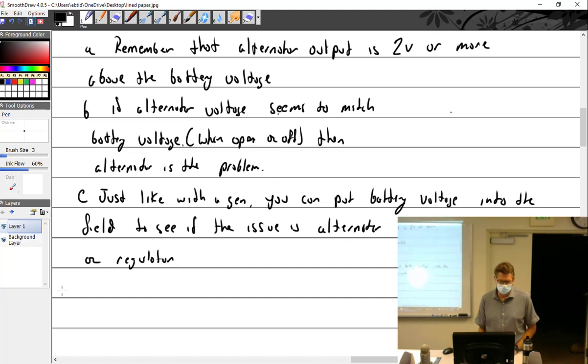So I was having a real problem with the system on my boat. I have an older boat, and it's kind of weird because the instrumentation runs off 6 volts, but the engine runs off 12. It seemed like the alternator was working, all indications were it was, but every time we'd go out, it would start up fine at the dock, and then when we were out on the river and started using it, it wouldn't want to work, and it was just driving me nuts.